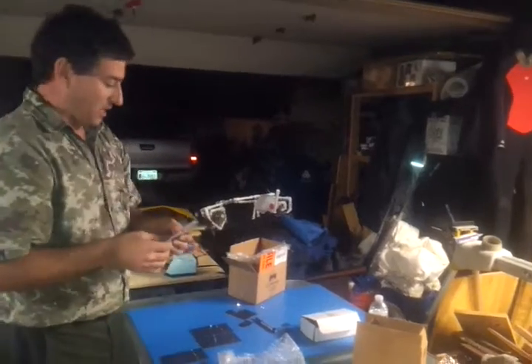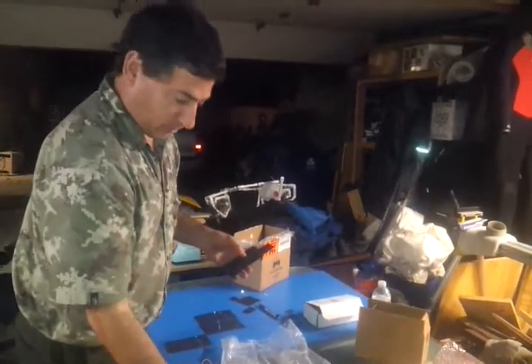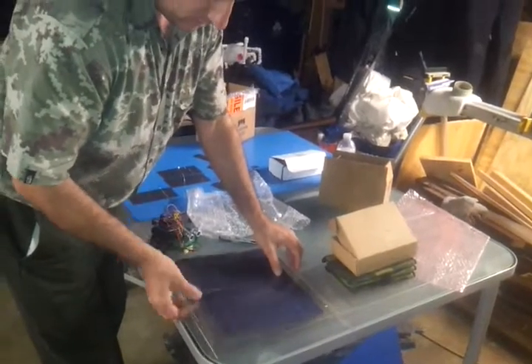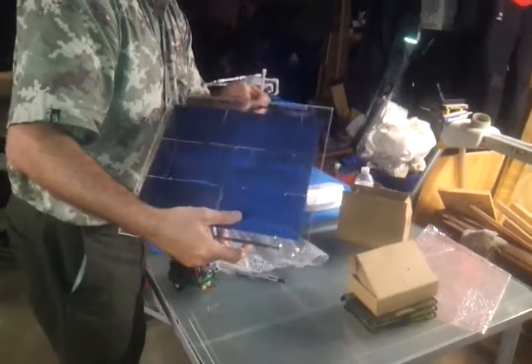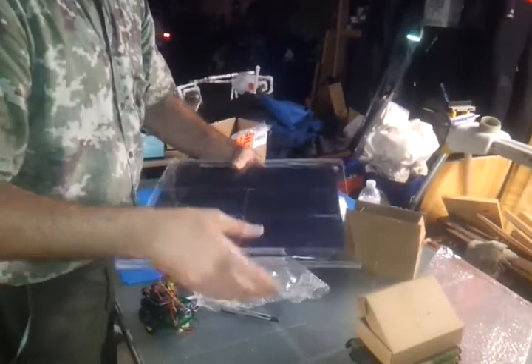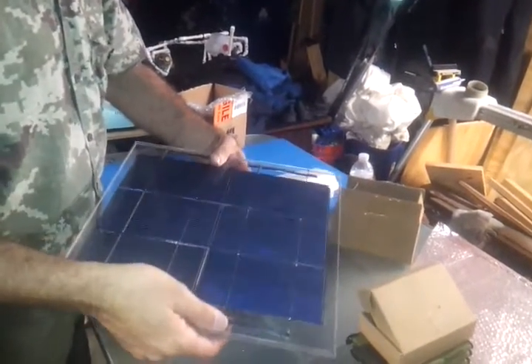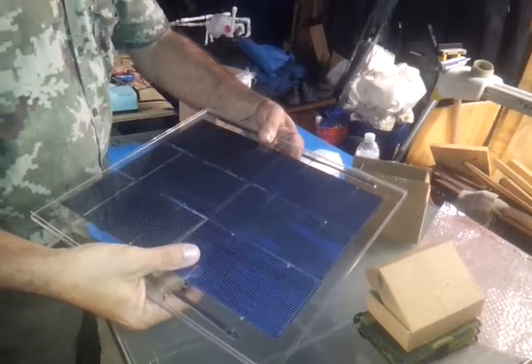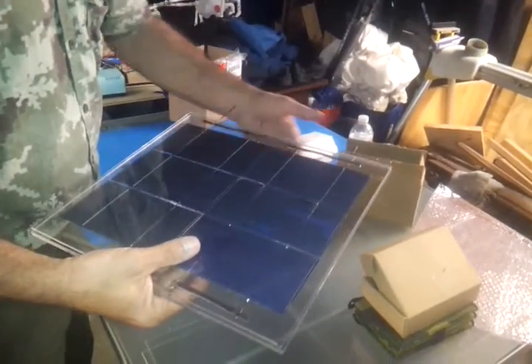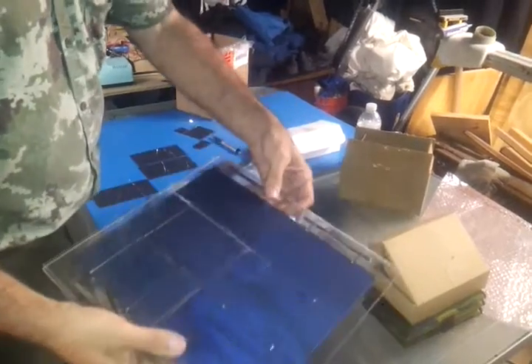When you get to the village, you can assemble these panels into your own solar panel, as you see here, which is what we're doing. This one that we're putting together with two plates of plexiglass is 3 volts, but much higher amperage because of the surface area. We can make them small enough to fit into our backpacks and then hook them together in series to make a larger panel.